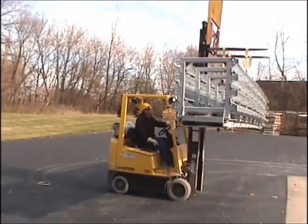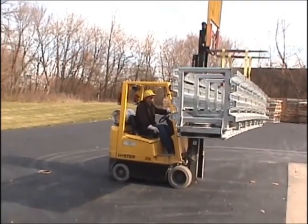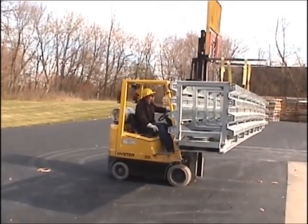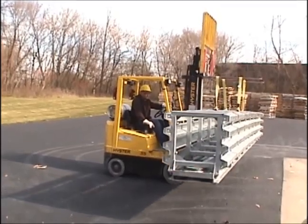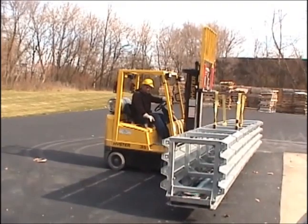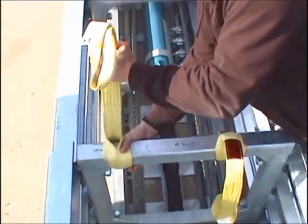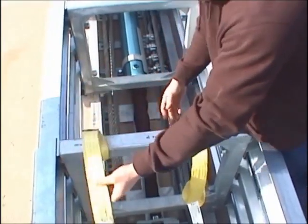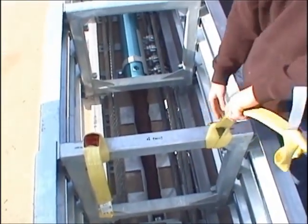You will need to safely unload the SCI 100 GM. Use a lifting device that can safely lift the 3500 pound attenuator and move it into position. Lifting straps should be attached to the support frames that are clearly marked on support frames number 3 and 4. You should use a 4-point choked lifting method.